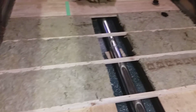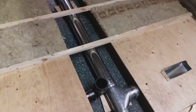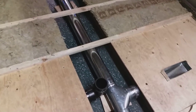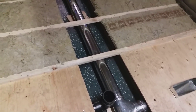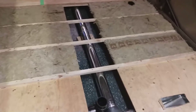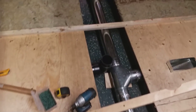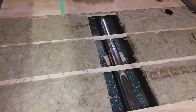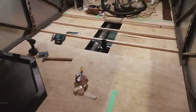Here's how I'm doing the insulation. I want to keep that channel clear, so I'm not putting any more insulation in it — there's already insulation under the original flooring. I want to keep it as clear as possible because that's going to be the return air channel. I don't want insulation falling in there and plugging it up. That pipe's going to be hot all the time, so it'll keep that whole area warm just by convection anyway.